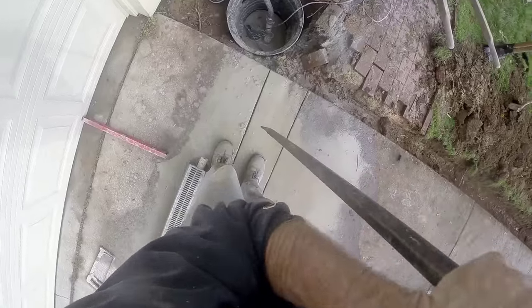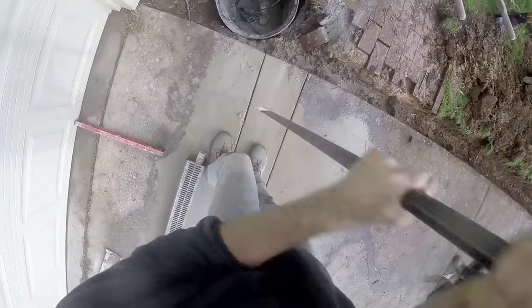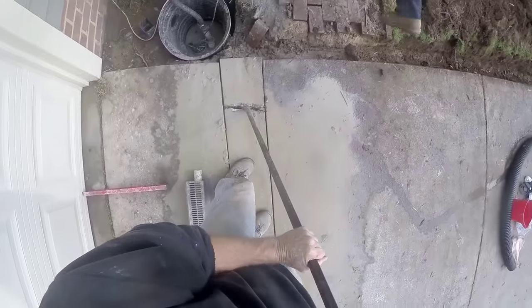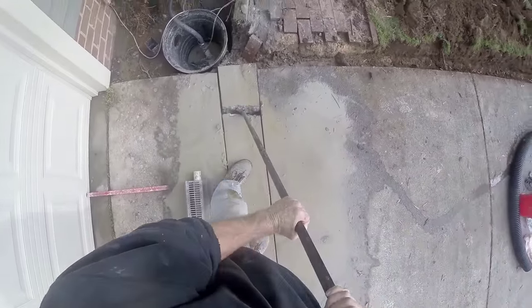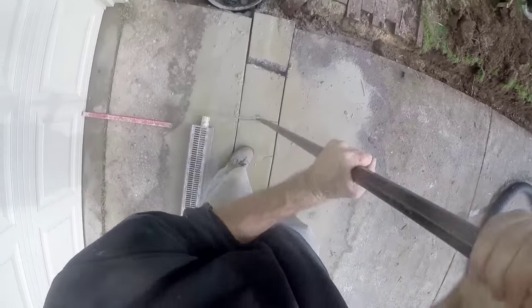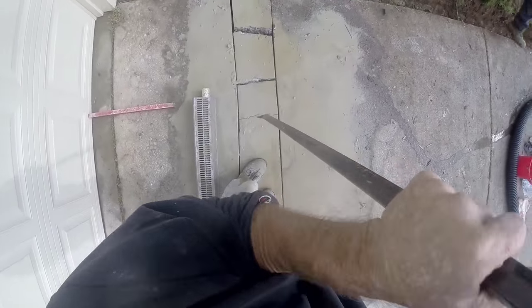Okay, so we finished cutting both sides of the concrete so we can install our channel drain. Now we're going to break this out. The secret to this is just keep pounding with your pry bar until the concrete cracks. I promise you that it will crack. If you cut all the way through it, you'll be able to do this in a matter of seconds.